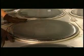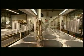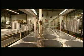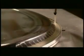This critical assembly step is done on the Evans gluing gantry, an Evans-designed custom-built machine on which the heads are placed on circular vacuum fixtures that are perfectly level. As suction holds each head steady, a robotic arm dispenses the epoxy into the aluminum hoop. The glue fills down through the tiny drilled holes along the perimeter of the film, then dries, anchoring the head securely into the hoop.